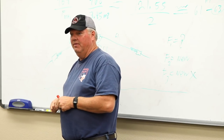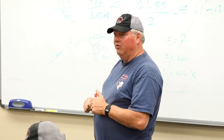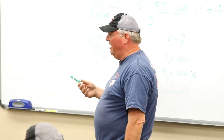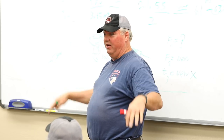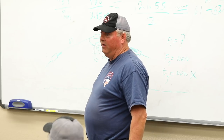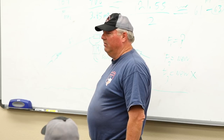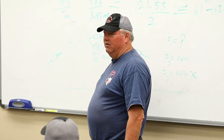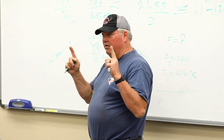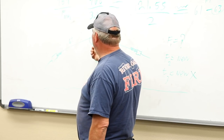In fact, just standing in the middle with your analyzer, you will affect it. Absolutely. The lower the frequency, the more your body affects it. That's why I was going to bring a 6 meter dipole and show you guys, but it's too big. The roof and the grid and stuff affect it. The wave on the 6 meter band is how big? 18 feet. Cut it in half, it's 9 feet. So I can't do it in here. I've got to make a little baby one, and we'll show you that on 2 meters or something.